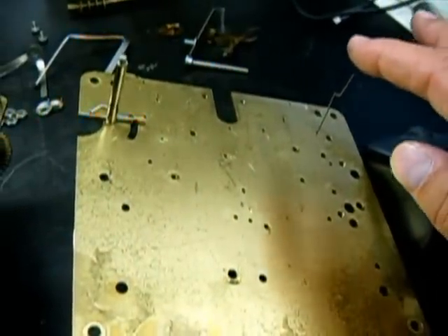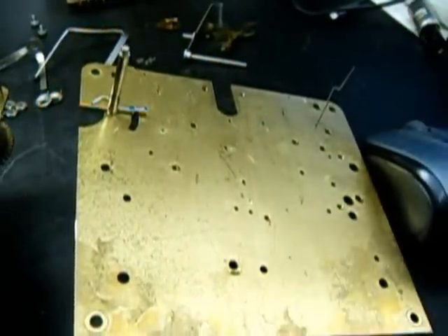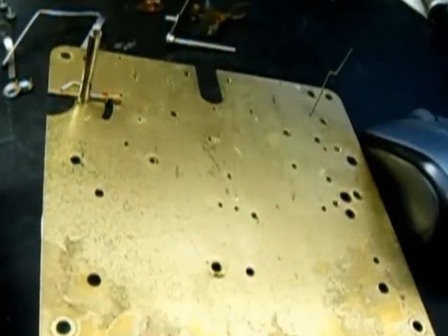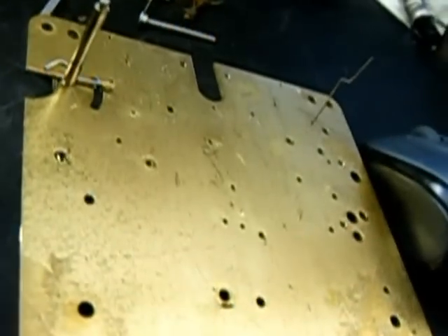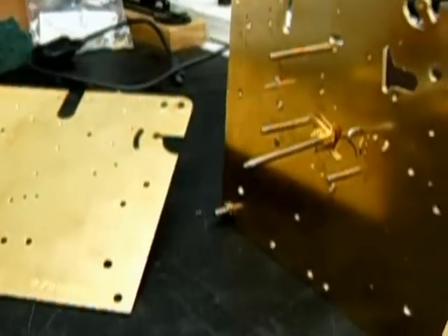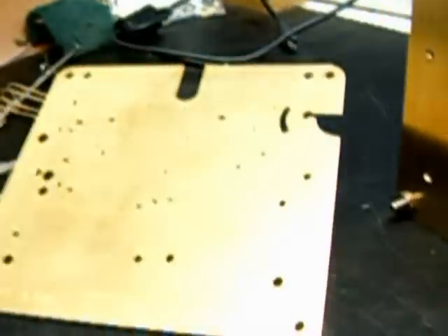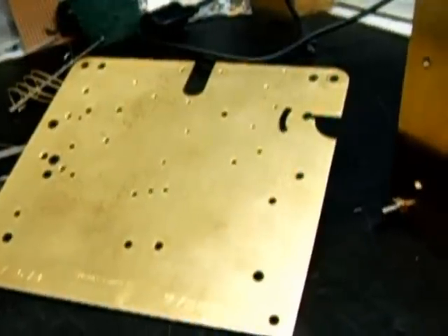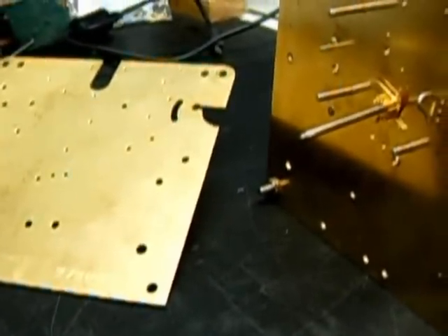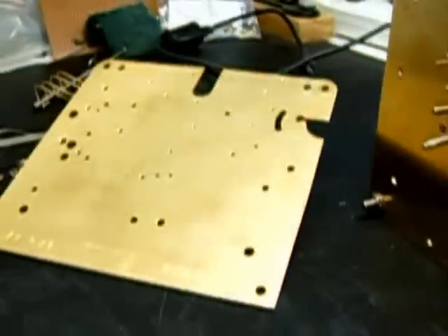Here's the inside of the plate, and you can see that little spring right here. That goes through the front plate and holds the flirt — the strike warning flirt — it holds it downwards. It has an interesting shape to it, probably clearing the wheel or an arbor on the inside. The ultrasonic does quite a good job when you know how to control it. I added a little bit of heat this time and the ammonia really shines up the brass nicely.